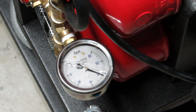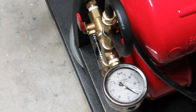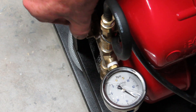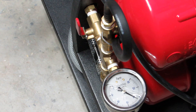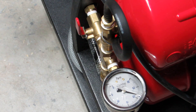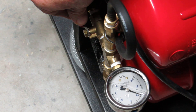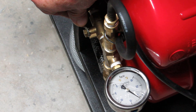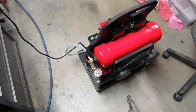We're down to about 20 inches. I'm going to open up this red valve and create a leak — at some point it should all turn back on again. Watching it drop: 19, 18... and yep, it's turning off at 23 and turning back on at 18 to 18 and a half inches of mercury.